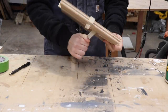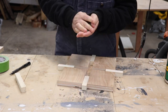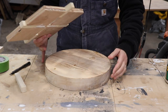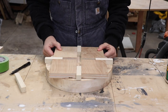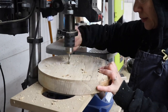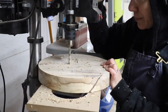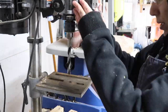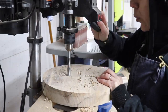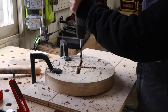For the top I'm going to be using this piece of spalted maple that I had already cut into a circle in a previous video where I showed how to cut a circle without making a hole in the center of your board. Turns out it didn't really matter for this project because I'm going to be cutting a hole in it anyway, so I marked out the X and brought it to my drill press and began to hog out the mortise. I started with a small skinny bit and quickly realized it was taking longer than it should, so I swapped out to a larger bit — that was a lot easier. I wasn't able to reach the center of the X on my drill press so I finished it off using my hand drill and that worked fine.